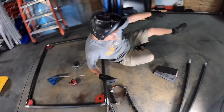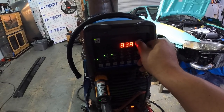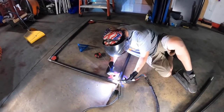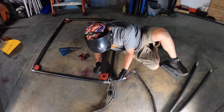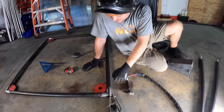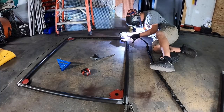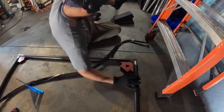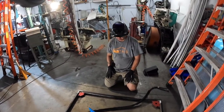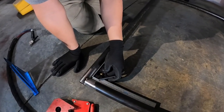We're using your welding settings from his exhaust — turning it up to about 90. So I'll just do one tack for now, move it around, get it all squared up. I'm gonna measure the tunnel, then I'll polish these two spots and put those in the top — check the squareness. We're looking pretty square.